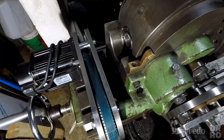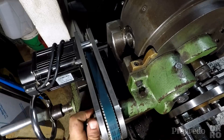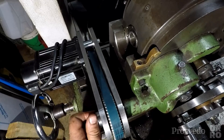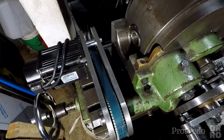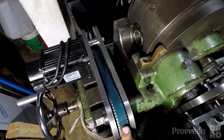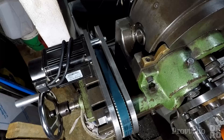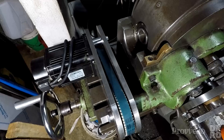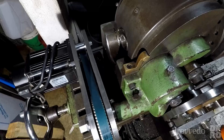I'm driving the dividing head through where you would usually add a gear train for helical milling, or anything that you'd synchronize with either the spindle or table. I've got a two-to-one reduction between there and the motor. The motor is a 750 watt servo motor and should be plenty strong enough to do what I want.